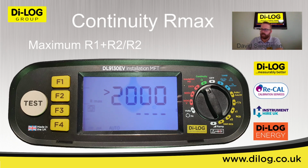So if you use your 13 amp plug or your socket adapter to plug between live and earth and conduct the tests, what it will do is essentially track the maximum resistance recorded on there. So I can just simulate this on a checkbox. It will always go to the maximum, so you've got 1 ohm there. But if I start going back the other way, closer back to the board where the resistance will be coming down, you can see the maximum R1 plus R2 is already recorded. So that's obviously on a ring main.